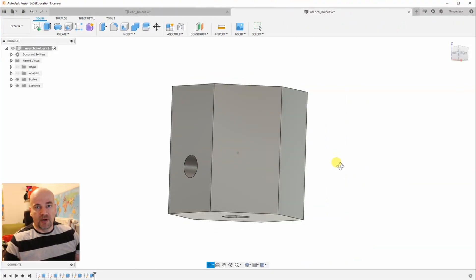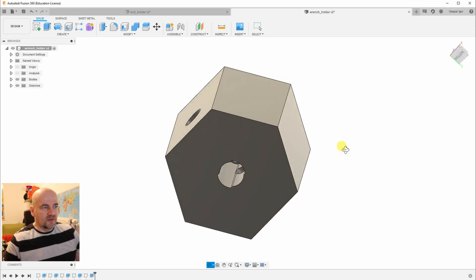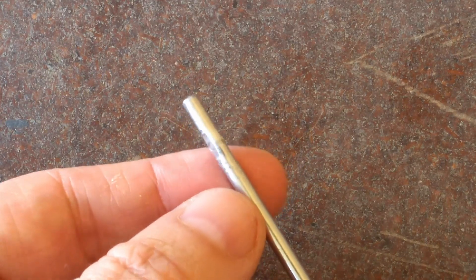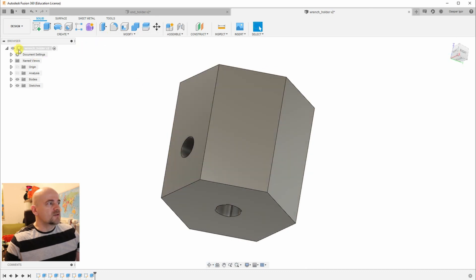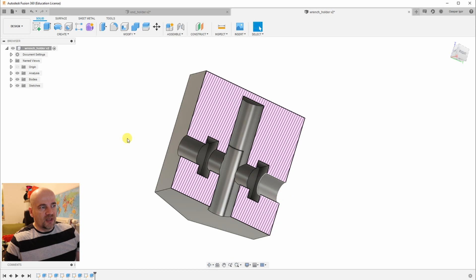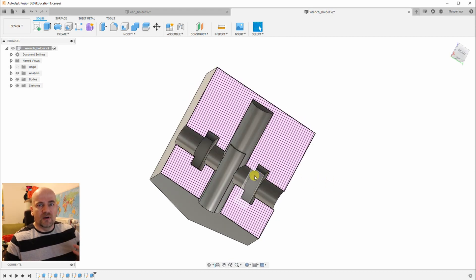This 3D printed part goes inside the wrench for testing. I had to add a wider area because when the flat surface was pressed onto the screwdriver, the shaft there became a little wider. Looking at the design, there are holes for two nuts — two M3 set screws go inside and squeeze the flattened part of the screwdriver. I like to use square nuts because they have a bigger surface to align, giving a better locked position.